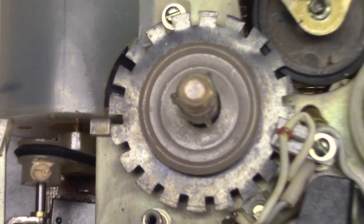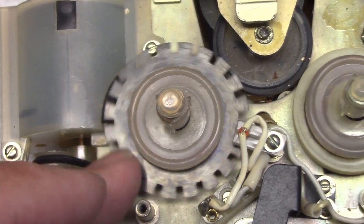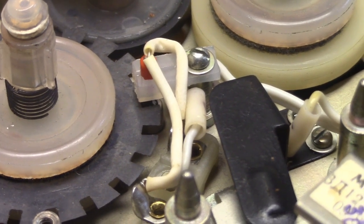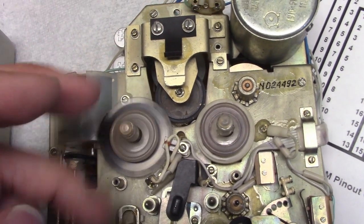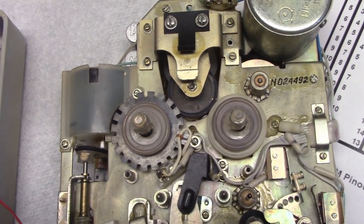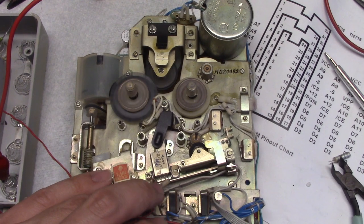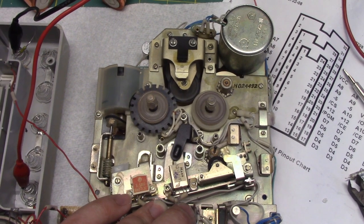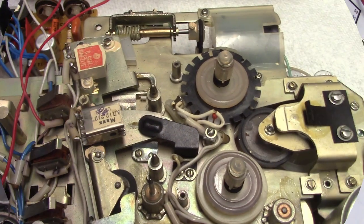You can see around the supply wheel, it looks almost like a gear. It's got little grooves in it, and it's got a little optical deal there. It's got a little infrared LED and detector so that it can optically sense whenever the supply reel is in motion. You cannot go straight between rewind and fast forward. You have to stop it first and then go to the other function. All those controls are done through digital TTL logic. Thank you very much. Quite the machine indeed, huh?